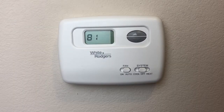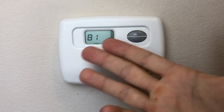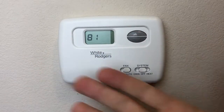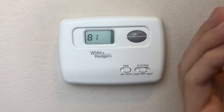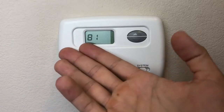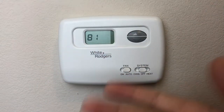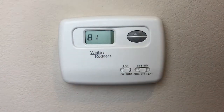It's fairly simple to tell if you have a C wire or not. The purpose of a C wire is basically that newer thermostats either have a backlit display or Wi-Fi functionality — something that requires a continuous flow of electricity. These older thermostats didn't really need a C wire; they just have a little calculator-style display that can run on two AAA batteries for quite a while.